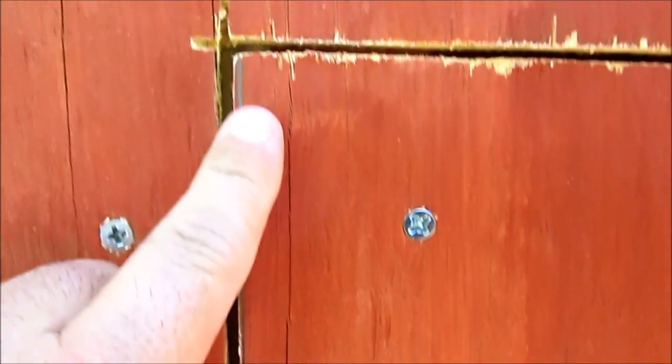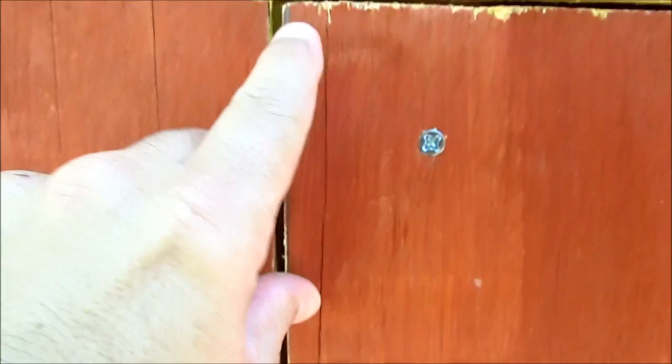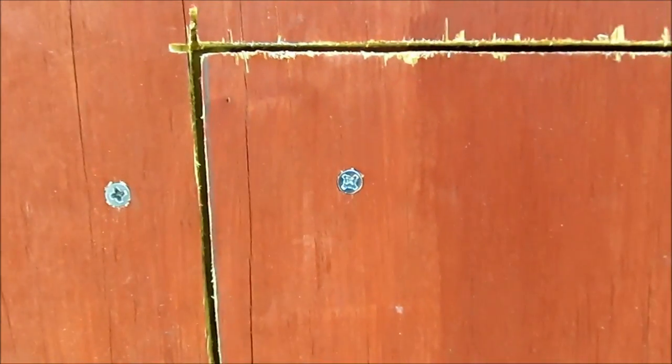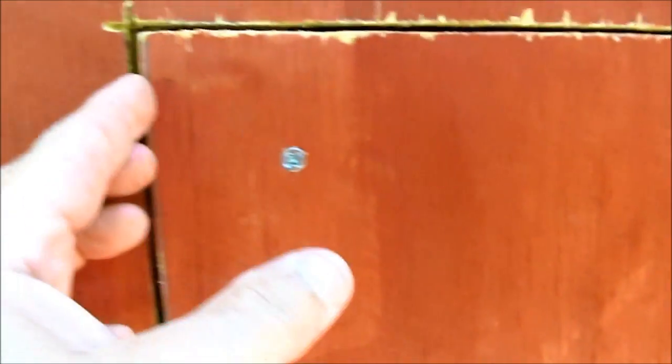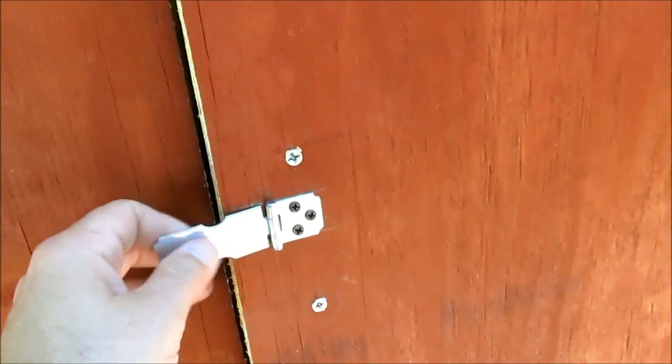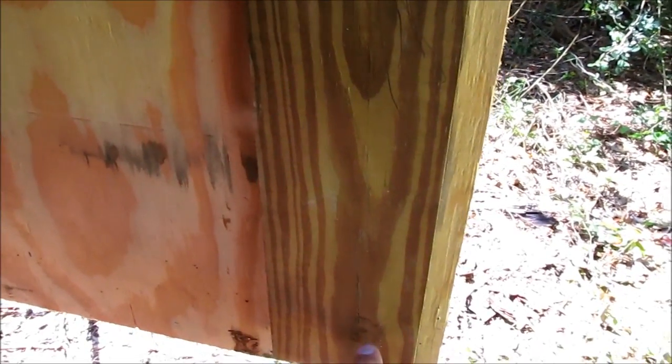We've got this overlapping about 3/8 of an inch as a wind and water barrier, so that whenever the cold weather sets in, we'll try to eliminate as many drafts or openings as I can. Another board is going to go right here down a little bit. You see how that's going to fit together, where we'll eliminate a draft hole right here. I'll have to come back and repaint all this. Used those 1 inch long wood screws, and they did not go through. Want to try to have as few as possible points sticking out so that the chickens won't get poked.